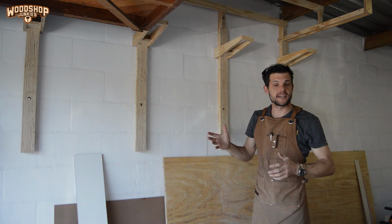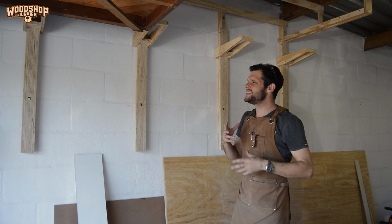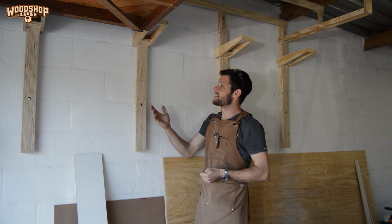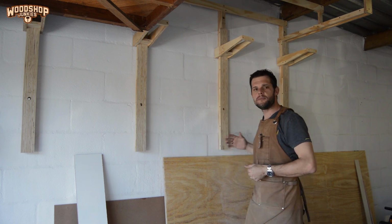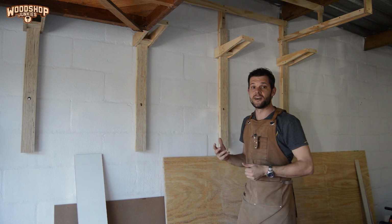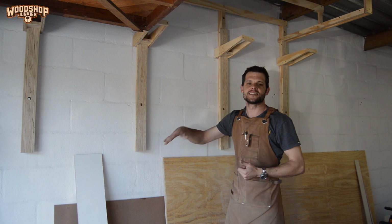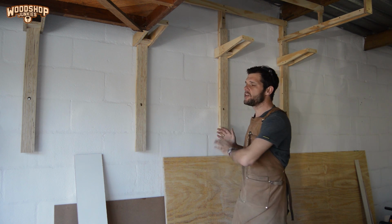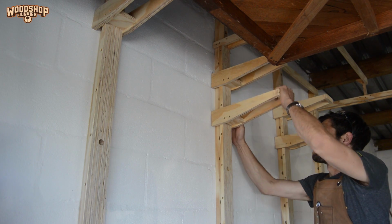As to why the rack is height adjustable, I'm trying to make the absolute most of a small shop, which means that I try to add a degree of versatility to all my projects. By making the rack height adjustable means I can store my stock as high as possible while keeping this space open to move around. I can then, as my stock increases or decreases, add tiers accordingly. This means that I only have to sacrifice this space when it is absolutely necessary.